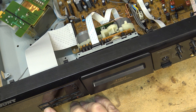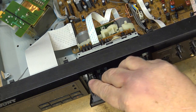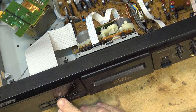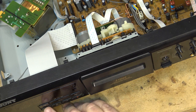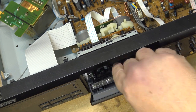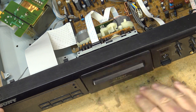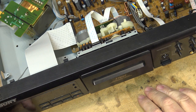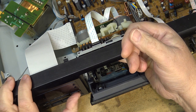It's got a noise in the background. It is playing the 440 tape. Okay. But it's got noise in the background. And the 3 kilohertz tape. It's not the right speed, obviously. The noise itself, unfortunately, is coming from the motor. The motor is shot on this thing. That's where that noise is coming from. This is what happens when you buy things off of eBay.